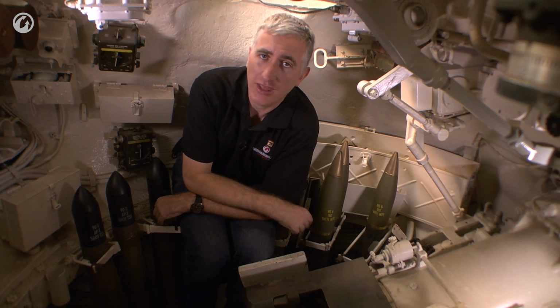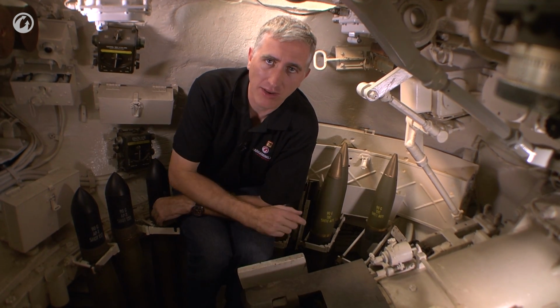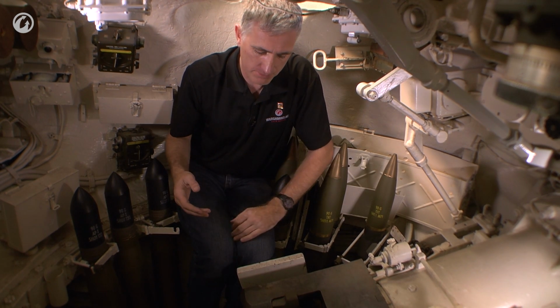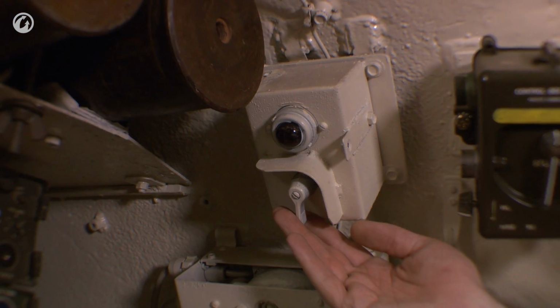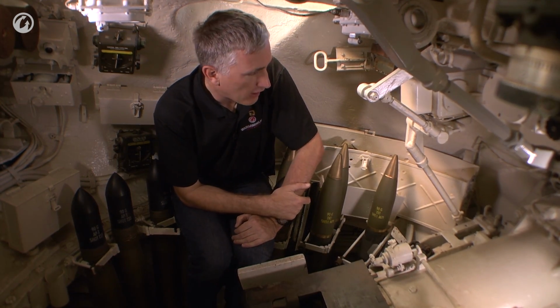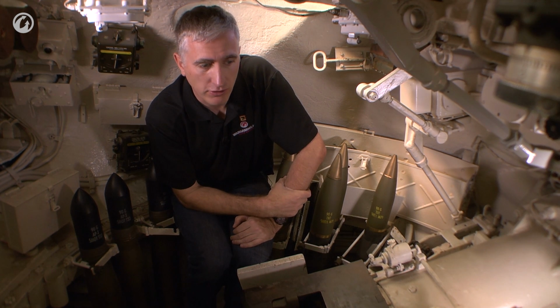The other interlock is simply the electronic firing switch. So if he has that set during the loading mechanism, the last thing he'll do is, once he is clear out of the way, and in fairness, there is a shield here for my knee, so I should be okay from the recoil, flip the electronic interlock, gun is ready to fire, and so the gunner can now service the target with the electrical trigger. It doesn't, of course, do anything with the manual trigger.